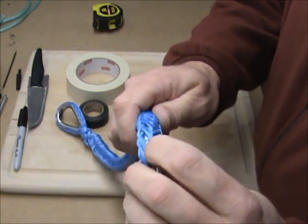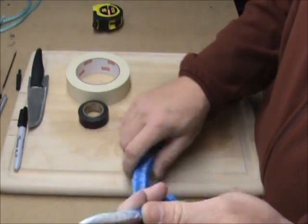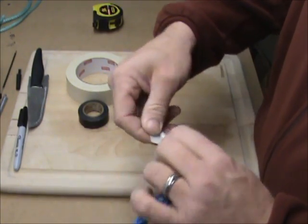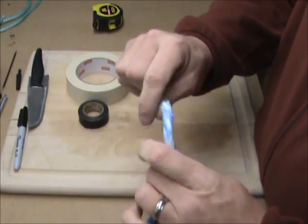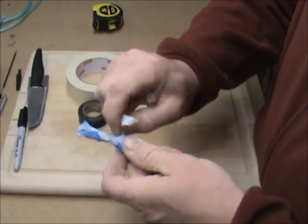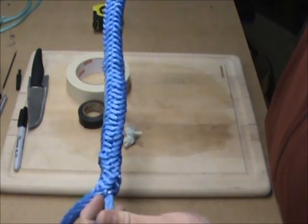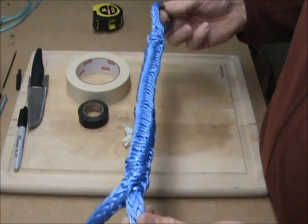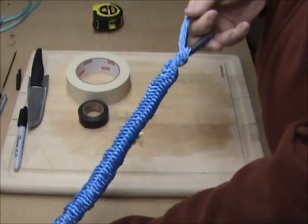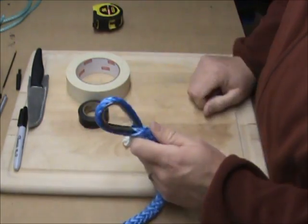Then just bring it out the line — it doesn't matter where, this isn't critical. If you've got some newer AmSteel, you may catch the tracer in here — cut it out. It serves no purpose other than to signify that you've got genuine AmSteel Blue. Then remove the tape — this doesn't need to be pretty, just get the tape off, you don't want to leave it on. Before you milk the outer rope back down, grab hold of your thimble and grab hold of your tail where it came out of the line. Push that up a little bit and give it a good pull to make sure that splice is set. Then come back up here and just milk that down. And that's it — you've just replaced your thimble.